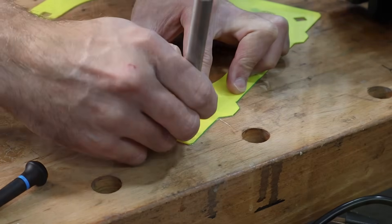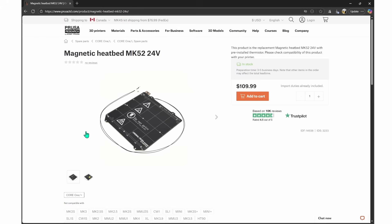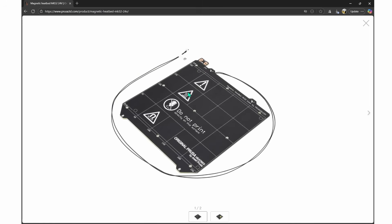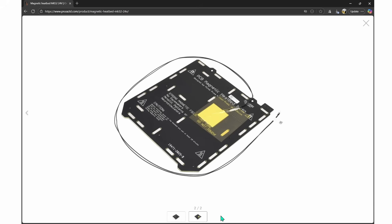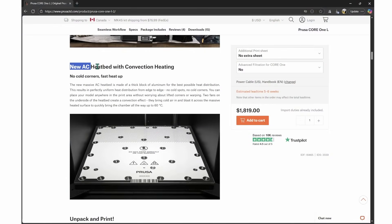The big changes came from the thermistor position modification and the aluminum foil tape, which dramatically reduced radiant heat loss from the cold spots on the underside — which may also explain why the X-frame below was getting so warm before. We still have a bit of heat loss in the middle but that's necessary for a more even bed temperature. This same bed appears to be used on the Prusa Core 1 and Core 1 Plus — it could benefit from these changes, though the enclosure on the Core 1 is pretty tight so it's less of an issue there. The upcoming Core 1L looks to have a thick aluminum bed so it probably won't have the same issues.